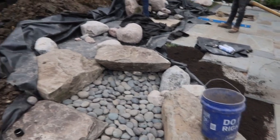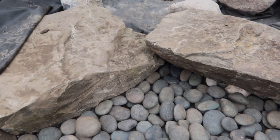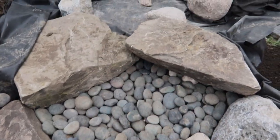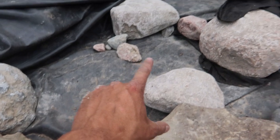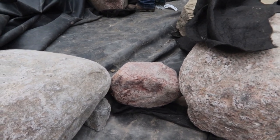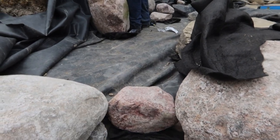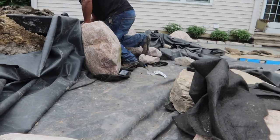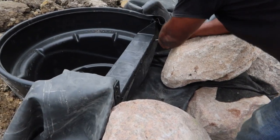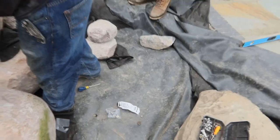I'm just finishing up that edge over there. We got our waterfalls 95% in. This waterfall here is going to dump into this basin, pool up, and then come down. We have this bib liner that comes all the way to here, so this is all going to be stationary with water all the time. It comes up here, kind of kicks back around this rock, and this is our other waterfall — more of a ripple. We ended up finding a rock that fit this area just right; it lets us dam up water just enough to have a deep pooling area. The guys are just finishing up putting the faceplate on the biofalls, and then we're going to get another rock sitting vertical against the face of that biofalls, dumping into this pooling area and then quickly dumping into the stream off this rock.